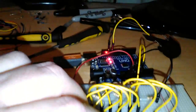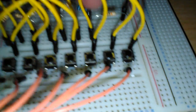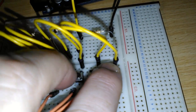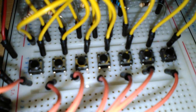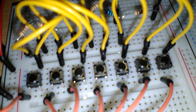The only thing it won't be able to do — because it's on basically a resistance line — is you won't be able to do two buttons at the same time. When you do, you'll get the one closest to the final resistor, since this last button connects directly to the end of the 10K resistor — that's the lowest path of resistance. So if you're holding that down, it doesn't matter what you do to the buttons before it, it will not change anything. You're not encoding buttons here — all you're doing is using a line of resistance along a path to find the shortest path back to the pin.